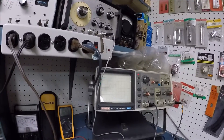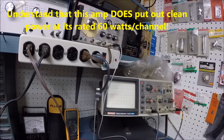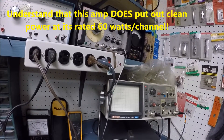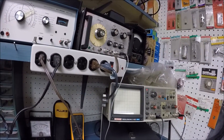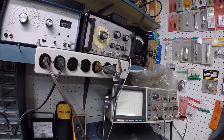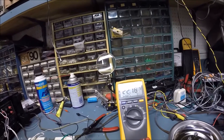If I push it even more you can see it sagging — that's where it's really struggling to hold up. If the power supply were completely stiff it would just be a flat top, but at 20 Hz even into a resistive load — let alone an inductive speaker load — it's a relatively easy load but you can see the sag. Still very clean up around 23 volts RMS, which is around 70 watts into an 8-ohm load.